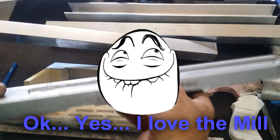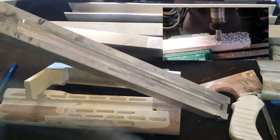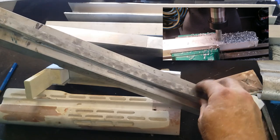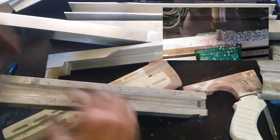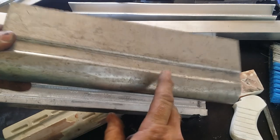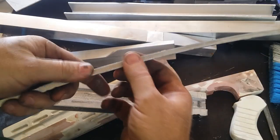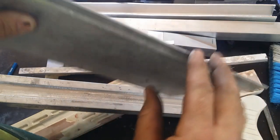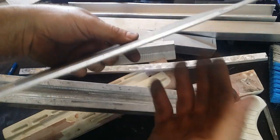Using the mill I've made myself a shaping tool. You can see there's a deep slot carved in there and a corresponding piece that sits on top, and the idea is you put the sheet metal in between and press in the groove needed for where the pump action slides. I had some limited success — I got to a point where a piece was just about right and done, and it broke off. The mistake I made was that when I did the first groove I had left a bit of a burr on the edge, and it was just enough to mess with the integrity of the metal and create a weak spot, so that when I started to put the bottom curve in it created a cut point where it just broke away.